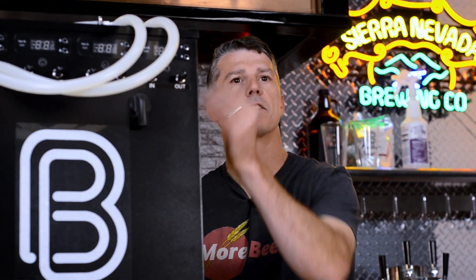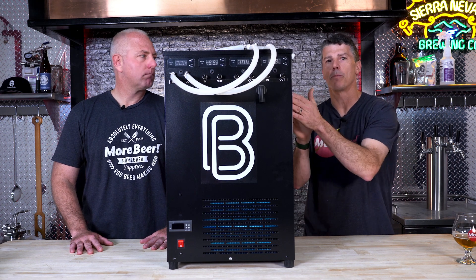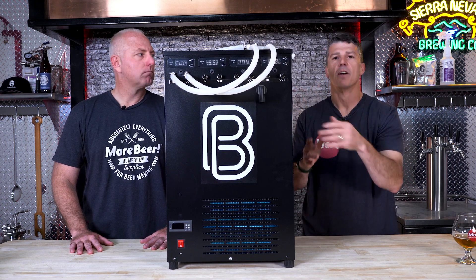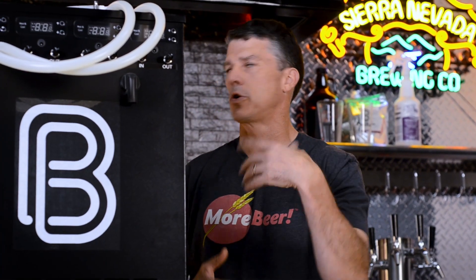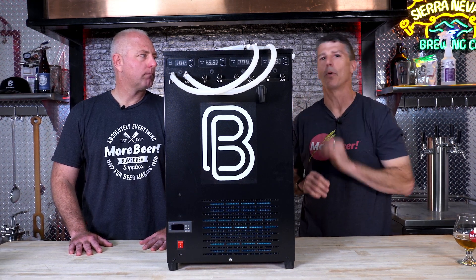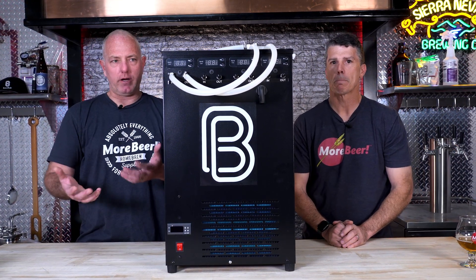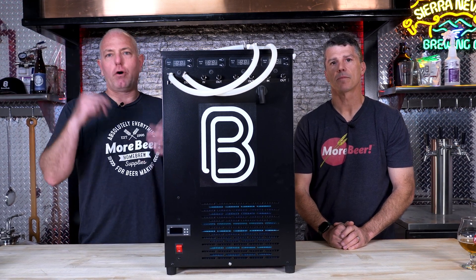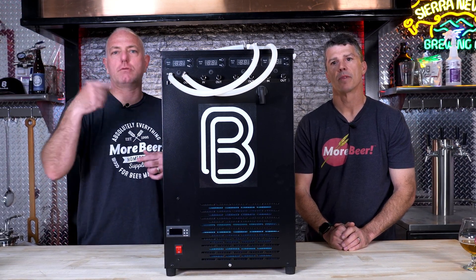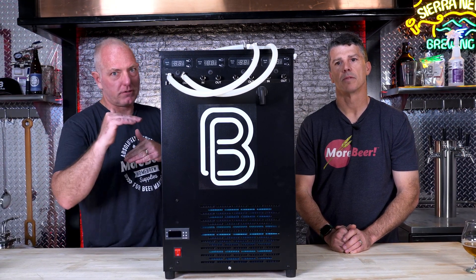You put a controller — these have them built in, some don't — and you decide what fermentation temperature you want. You literally pump the glycol solution from the reservoir to whatever your heat exchanger is, through your jacket or coil, and back, and you can get pinpoint accuracy doing it this way. Think of it like using a refrigerator: the temp controller tells it to turn the refrigerator on. All this does is tell it to turn the pump on, so it starts pumping that liquid, exchanges heat, and cools your beer. When it hits the temperature you've set, it stops pumping.